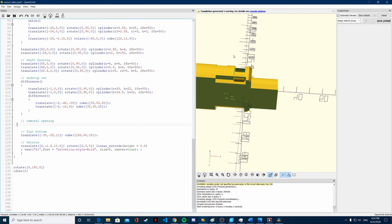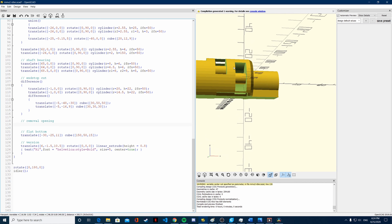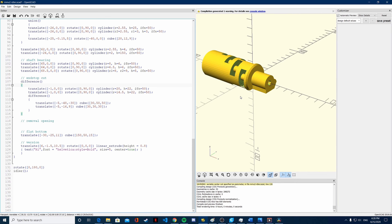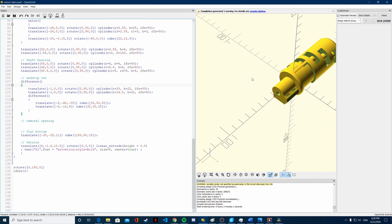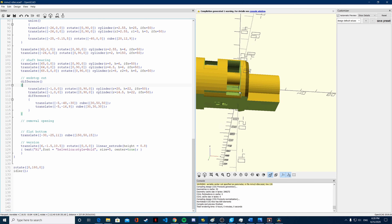It touches on this side and on this side as well, so that's two things that we have to fix. In order to fix those two holes inside the idler, we first have to move that cylinder — it's the cylinder making those holes — about eight millimeters to the left in order to make it fit properly, because we also had the bearing clearance I didn't initially take into account.